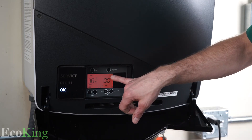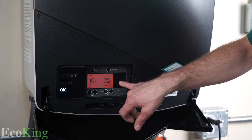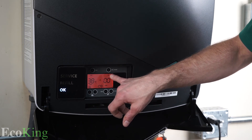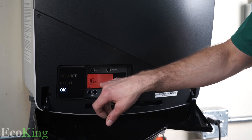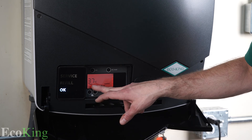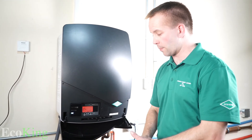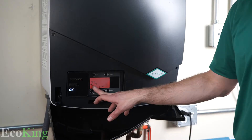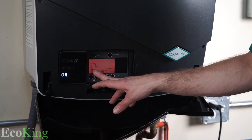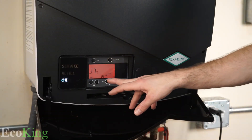We should flash 'okay' in the next few seconds. The flame went off the screen and the ladder went off the screen. At this time you will see 'test' on the screen and the fan is going to run. The boiler is not technically fired — there is no flame, but the fan is running. This will happen for 10 minutes. After 10 minutes, the word 'test' will go off the screen, and the boiler is going to start up.